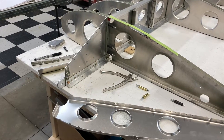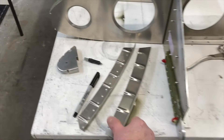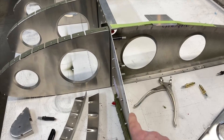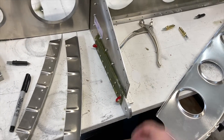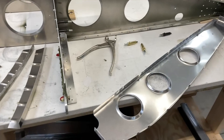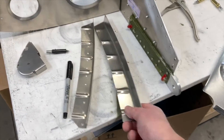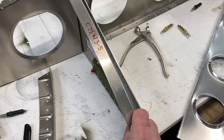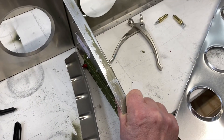Same with the front nose rib. My theory is that these are older style, because these holes are smaller — set up for the original rivet size. Now they've upsized it so you can put an AN3 in it, and they've changed this so it's 25mm across the top. I think that was just for better edge spacing, because this one fit nice.